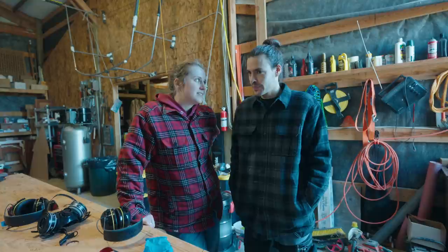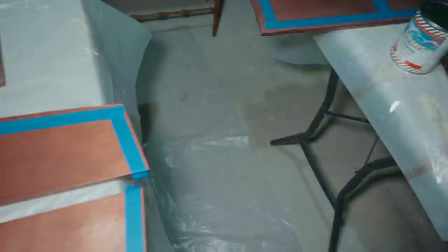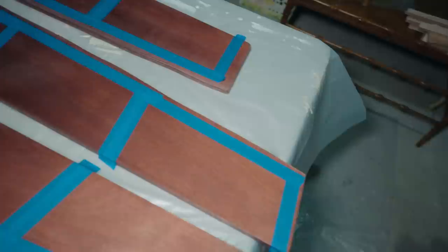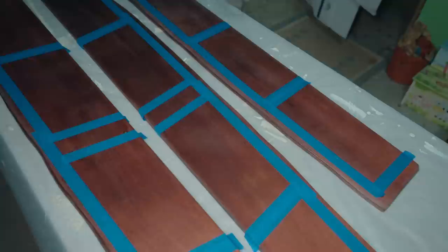I mean, yeah, often there is no such magic. Especially if you want a nice finish, there is sanding involved. But now that we already have an epoxy base and that one has been sanded, there is no wood grain to lift. So if we are careful about it, we should be able to put on 2 to 3 coats and hopefully get a pleasant result, which is all we're after here. Let's get into it. All right.